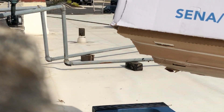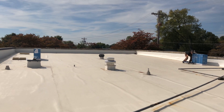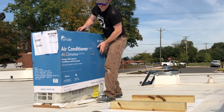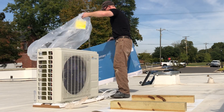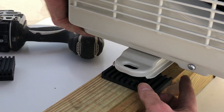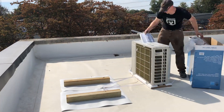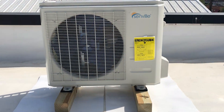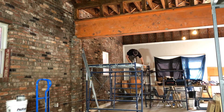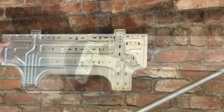Moving the outdoor units from the pallet to roof level wasn't difficult with a forklift involved. I solicited a few quotes for mini-splits for this space. Although I requested quotes for two 1.5-ton units to compare apples to apples, all the quotes I received were for a mini-split with a single outdoor 3-ton and one or two indoor units. The quotes were between $7,500 and $8,500, and included equipment rated between 16 and 19 SEER. The total cost for the two Senvil Aura 18HF units is $2,800.